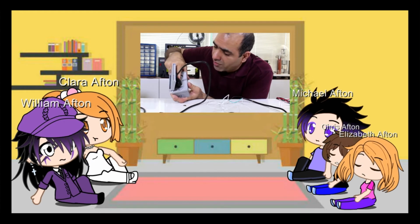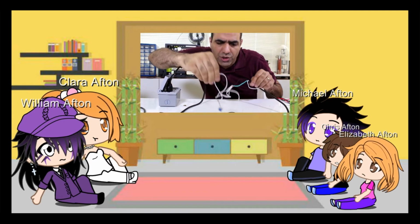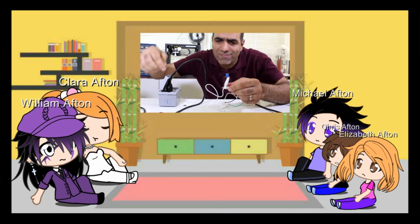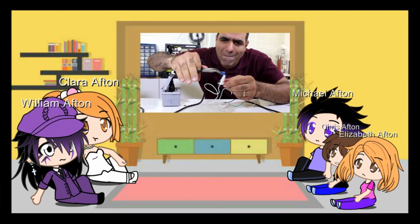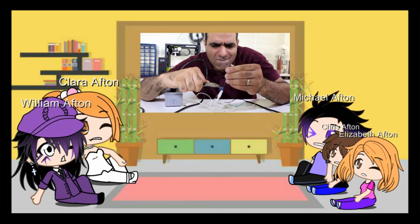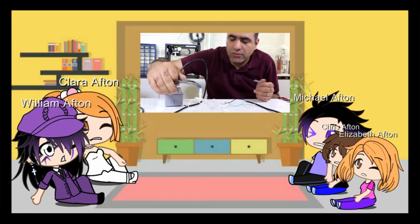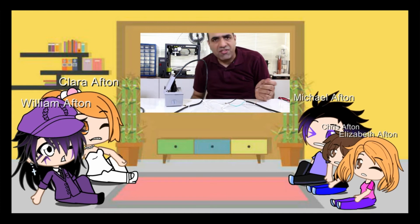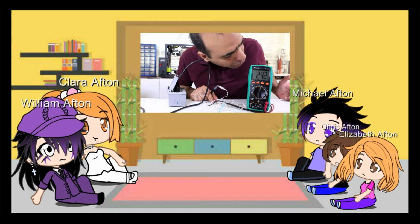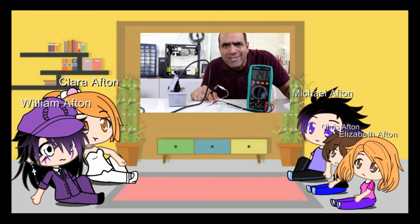Okay, I bought this GFCI outlet so I can try it outside the washroom. And I connected a potentiometer between the live and earth to see exactly where it will trigger. Make sure we don't short anything. High voltage makes me nervous as f. Let's check the potentiometer resistance. Pretty much 24 kilo ohms, which means 120 volt AC divided by 24 kilo ohms is exactly 5 milliamps.